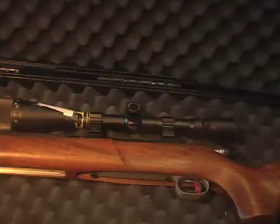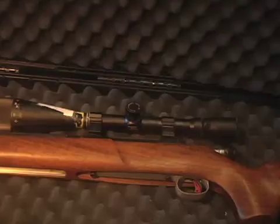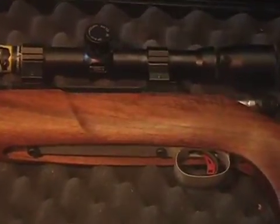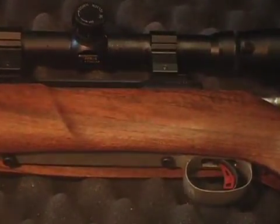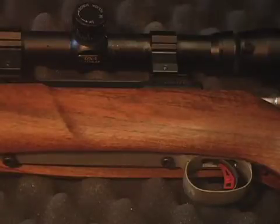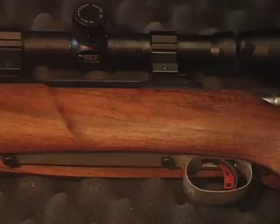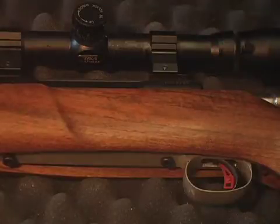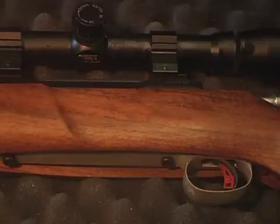I trued the receiver up. I was using the Savage precision receivers to build target rifles on. They're about $550. They're an excellent receiver. Then they came out with this, almost as rigid, and I say almost because I can't measure the difference. I put a 25 weight on the end of the barrel, both guns set up in a vise with a Starrett last word micrometer on the end, and there was no difference in either the precision receiver or the rigidity in the Axis.